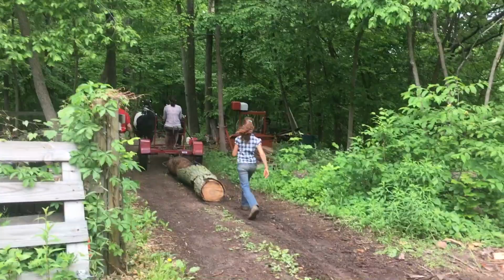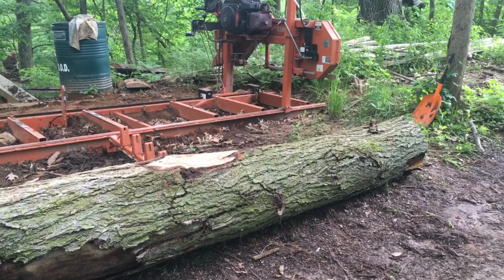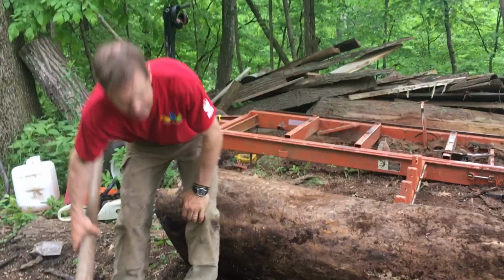I've got a couple of challenges with this because it's not perfectly straight. The other thing is, about 9 feet down, I've got a knot on this side, and so I'm going to have to use the other side because I need straight grain uninterrupted for 14 feet. So it might be kind of tricky, but we'll see what we can get out of it. If nothing else, I can get some 9 foot lengths, maybe split a few Pitman bars or something like that out of it. But ash is a really good wood to use, so we'll try to get this up on the mill.